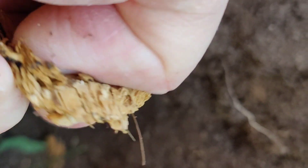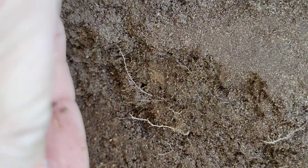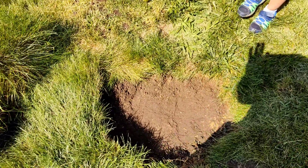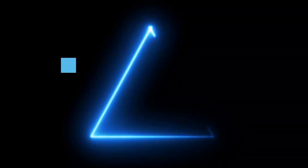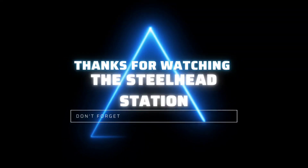You're going to need to dig this stuff out. Otherwise, if you just put sand on top, it's just going to continue to sink as this basically becomes nothing. So go in, dig that all up, go through the whole process again, fill it in, have your best buddy stomp it down nice and smooth, and you'll be all set and ready to go. Thanks for watching.